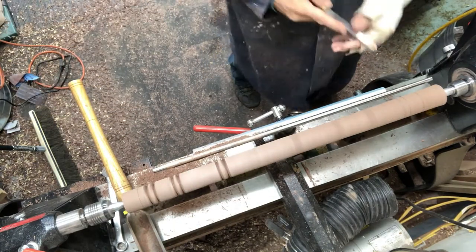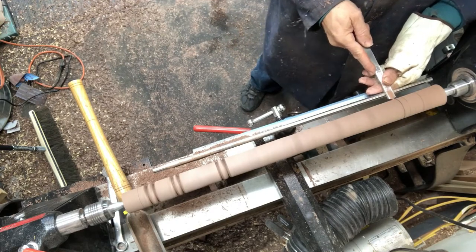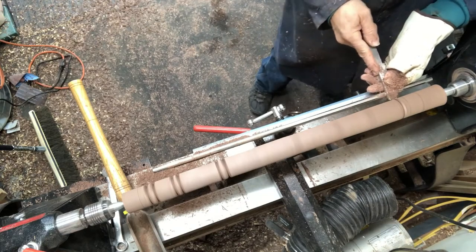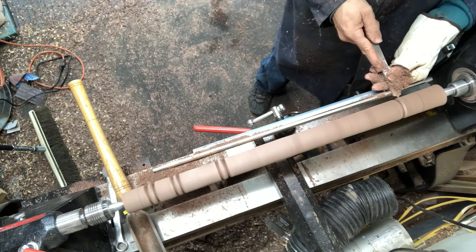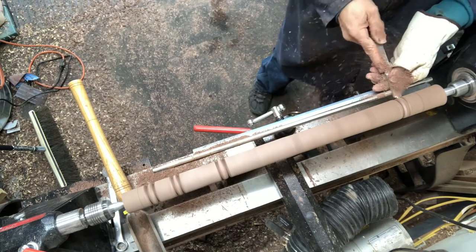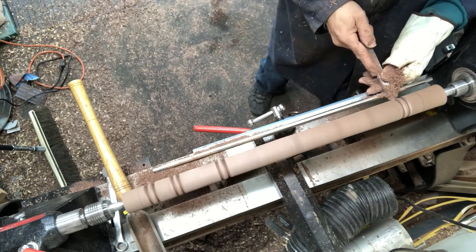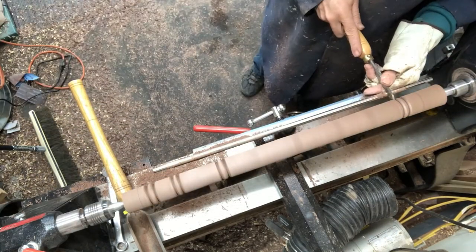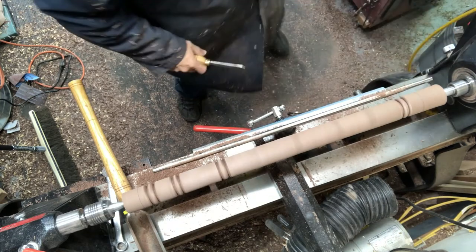Now I've got the top beads in place. Now I'm going to go towards the bottom and put the bead here — that's going to be the top of the bead where the taper goes down. Here I'm just using a parting tool to get down to the bottom of the bead, and that's where my transition point will be for the taper.